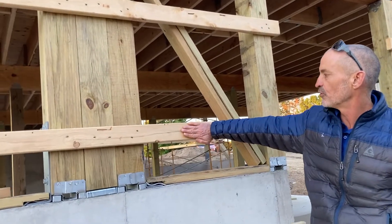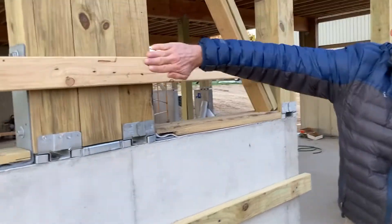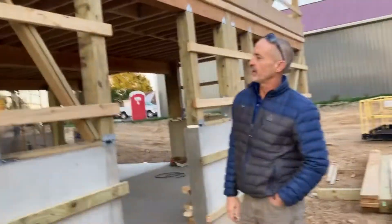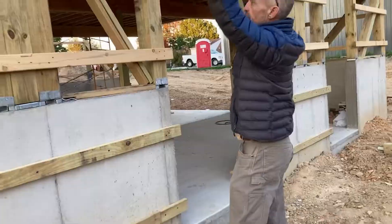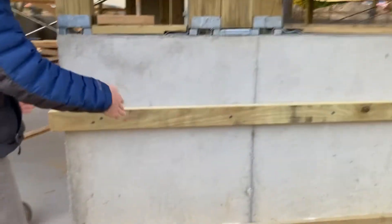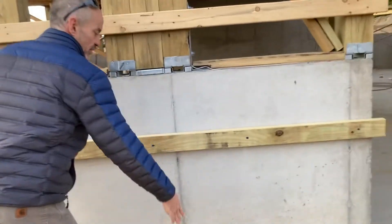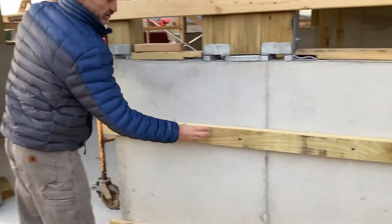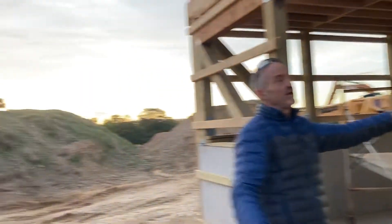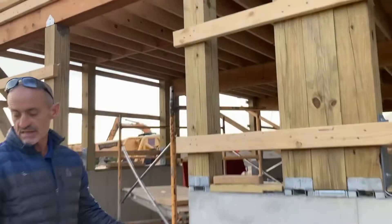This right here is a two-by-four — not pressure treated — but notice they're all going horizontal and they're spaced two feet on center all the way up the wall. The reason they're on there is we're going to put vertical siding on this barn. We need to fasten the siding into the purlins, so we'll have approximately 38-and-a-half-inch long metal steel planks that we fasten to the barn, attached to the purlins. This is very commonly used in barn construction when assembling anything with vertical siding.